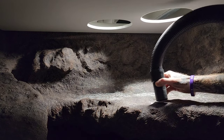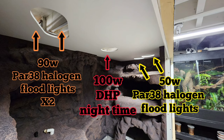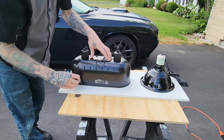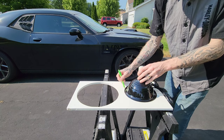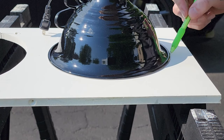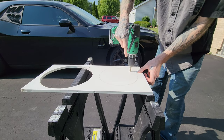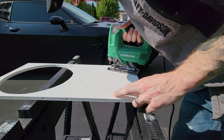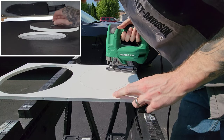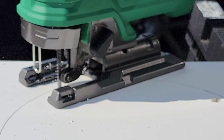Vacuumed up the mess that was created. Here's a ceiling plan for my light placement. Now to start the light trim for the inside interior. Traced out the lights tight to the dome, drilled a hole to the inside of that line, and used the jigsaw to cut it out. I saved the cutouts so I can use them as plugs later — this cut will be the inside diameter for my light trim.